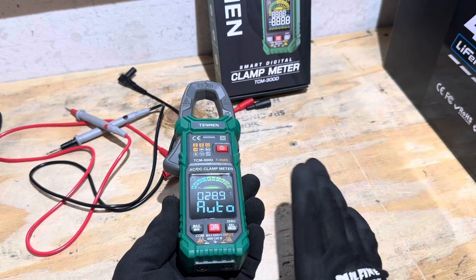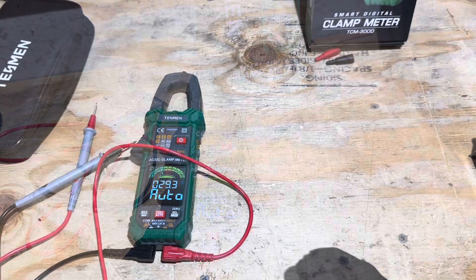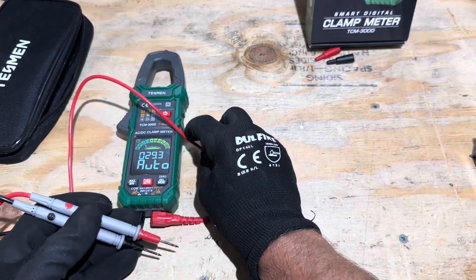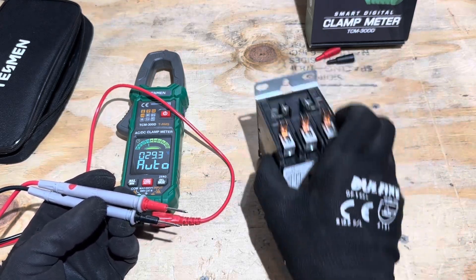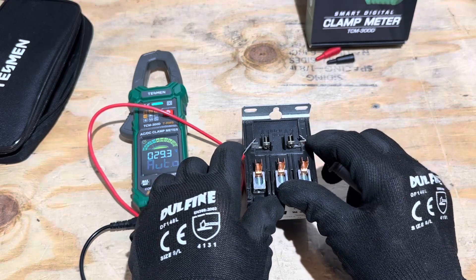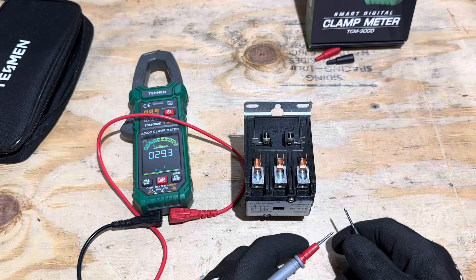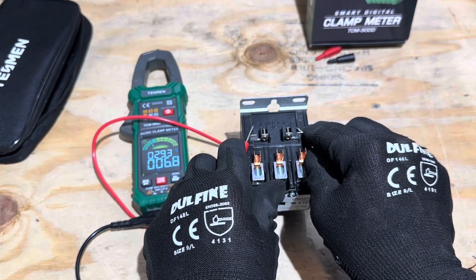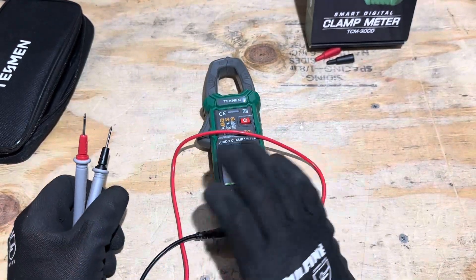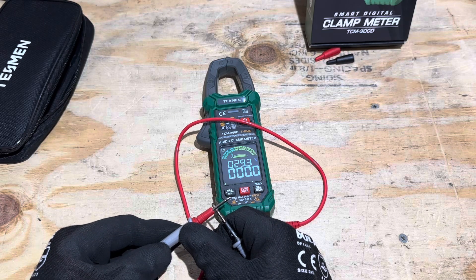The AC current tracking works just as good as the DC — I'm just not taking the panel covers off today. I've got the leads back in the meter. I've got a three-pole contactor here and I'm going to check the coil to see if it's good. Probing the coil, it goes to continuity — 6.8 ohms. Checking on straight resistance across the coil gives the same result: 6.8 ohms of resistance across that 24-volt AC coil, which is right. A good way to check your leads on low-price meters is to check across the leads themselves and make sure you get a complete zero reading, which this one does.